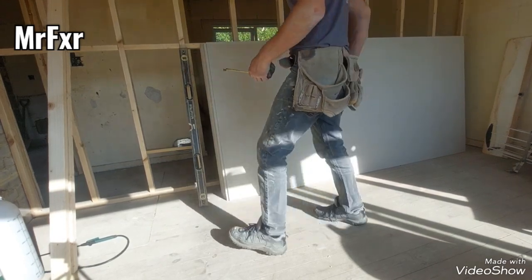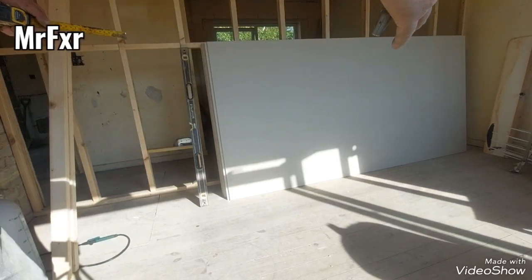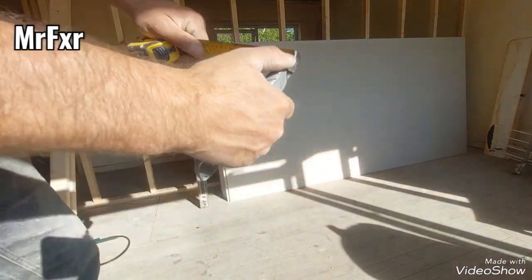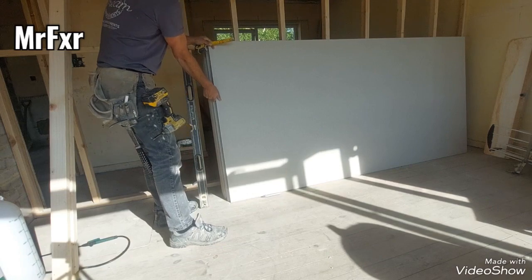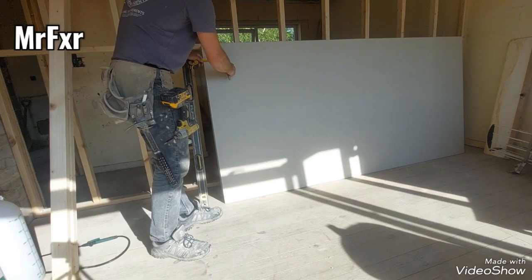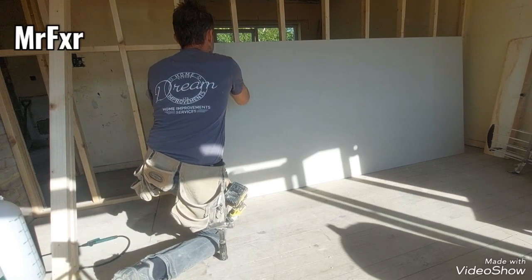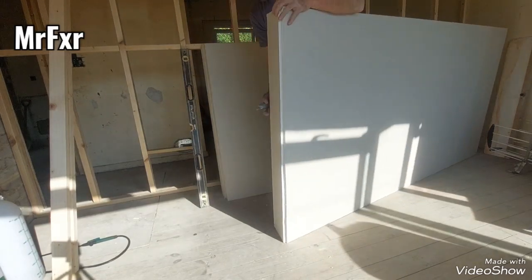Two ways of doing that. One fast way would be for narrow strips or anything that you can reach. In this instance it's 6 inches. I could put the blade of the knife, hook it on like that, on the edge of the tape, put my thumb to it to hold it, and then run my finger against the board, with the knife on this side, and I can actually pull it like that. So you don't need a straight edge or anything.